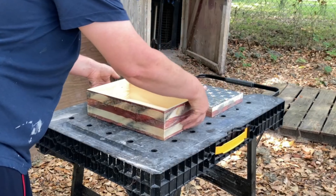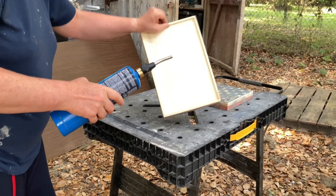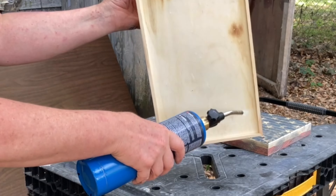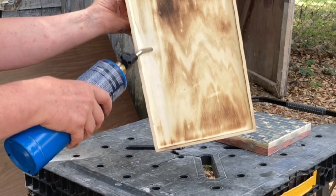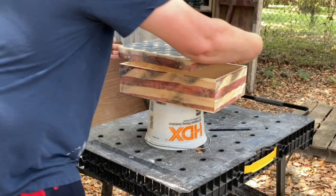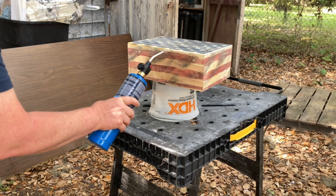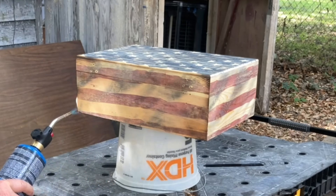Once the transfers were complete, I decided to try burning the surface a little bit. I don't know that I would consider this a full shou sugi ban method since I'm not charring the outside — I'm just singeing it slightly. When putting the torch to the box, I really wanted to concentrate on the corners and darken those, and kind of let it lighten as it got towards the center parts.